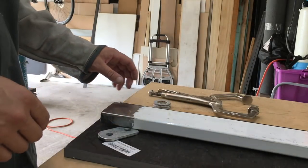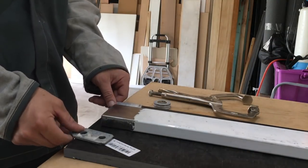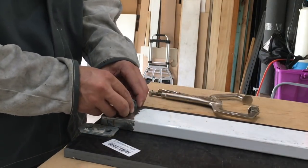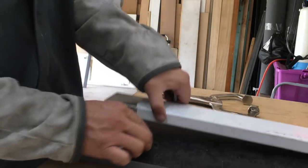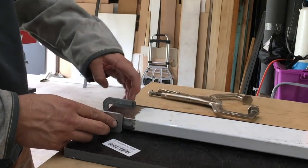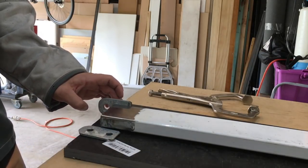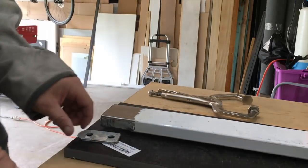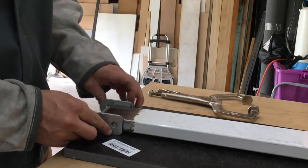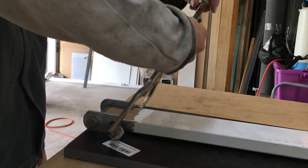What I'm doing here is the swing arm — I'm going to put these two little brackets on the end that hold the bolt at the very top. The overall height is a little bit under but it doesn't matter. If I lift that up and put those on, it's going to be even in the middle — that'll give me a weld in there and on the other side and on the back. I'll throw a bolt in it for now, at least get a tack weld on it for now, and then weld it out later.